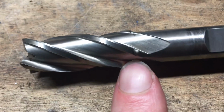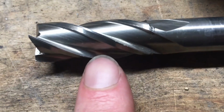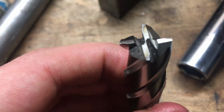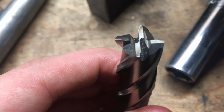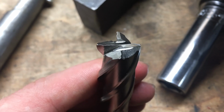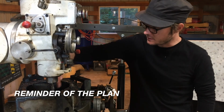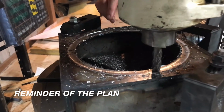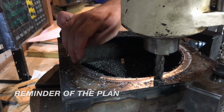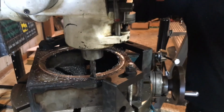These notches on the side were kind of already there when we started, but we did a lot of it along this part, and it looks totally fine. Maybe these corners are a little rounded off. But other than that, I'd say this end mill could be used for something else another day. So we made a machined surface around the inside and then on the top, so that we're going to be able to have a lid that will sit on this surface, and then it will have a little lip on the inside that has the same outer dimension as the inner dimension of this circle.